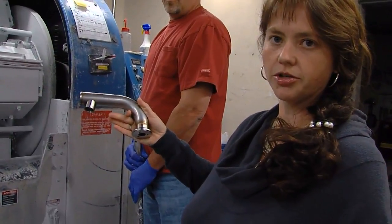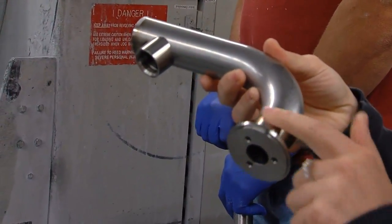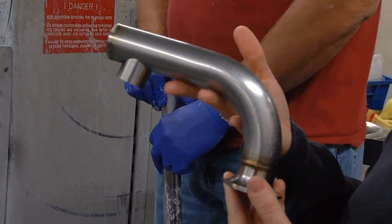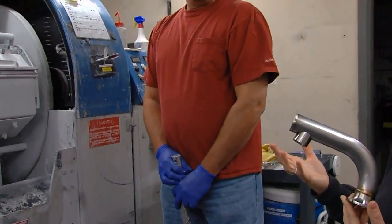What we have here is a coffee nozzle and we put it into our machine to achieve a very bright polish so that it can go on to a coffee machine. This is a welded piece — we welded this on and this on — so you can see it's kind of a rough finish. We put it into our machine and we're going to run it through a cone process to smooth all surfaces.